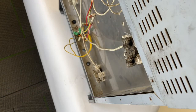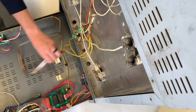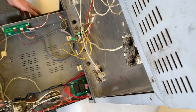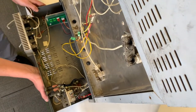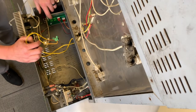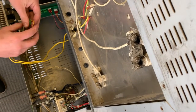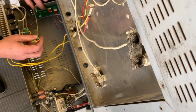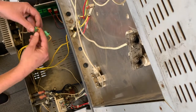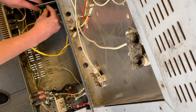Now let's go ahead and install the tray to the NCAT furnace. Next, we're going to connect our thermocouples. The interface board has labeled which thermocouple goes to chamber and which goes to furnace on the actual board, so you'll just want to make sure you're connecting the right thermocouple to the right connection. The outside one is the chamber, so we'll look for the C that we marked earlier. And the one next to it would be the furnace.